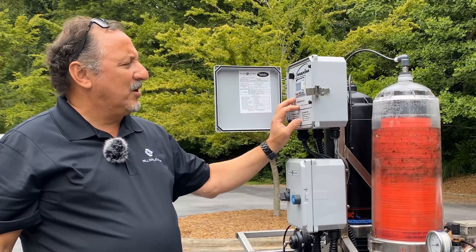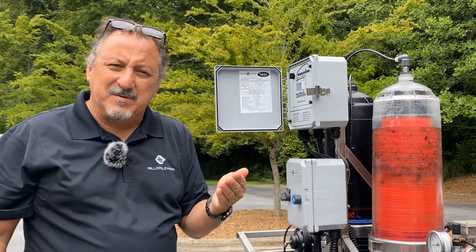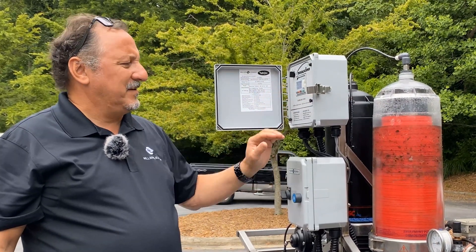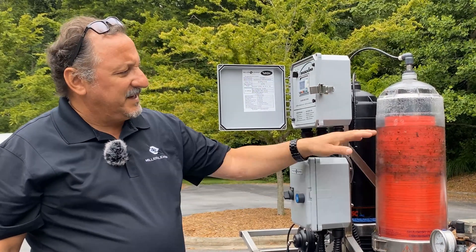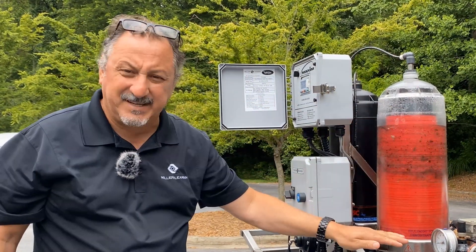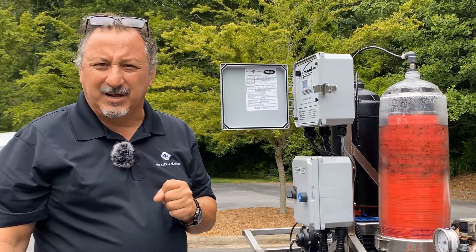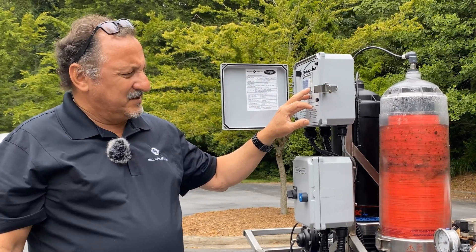We're building a small pressure differential right here of around 2 PSI. We typically back flush your systems at around 7 PSI differential. So what I'm going to do is manually back flush the system right now. What you're going to see is the disc stack separate, the 25 PSI push all the contaminants and water out, and the 125 jets spray out tangentially, scour and clean the disc.